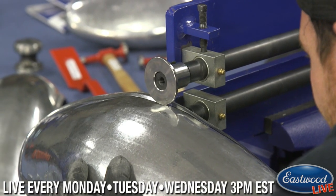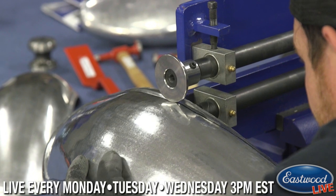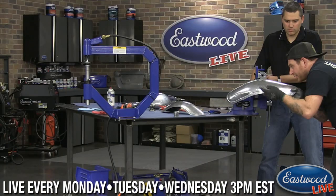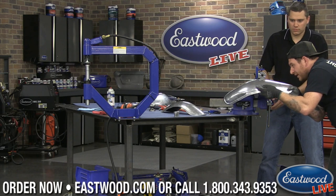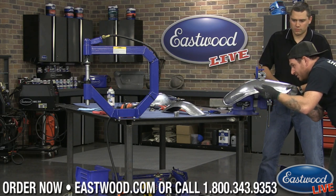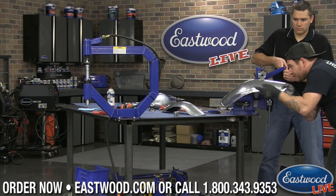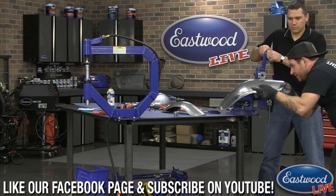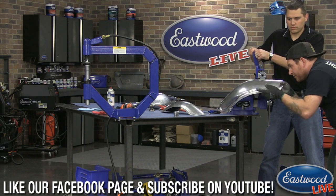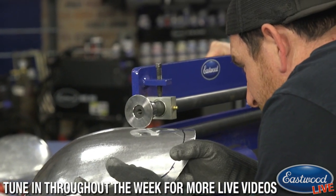So the key with rolling this, when you have a helper, is smooth and steady. You don't want somebody that's stopping part of the way through. I've seen some guys modify their bead rollers and put big car steering wheels on them, like a 50s car steering wheel or even something from a semi. It allows you to continuously turn the wheel without stopping. If you have problems with that, you can also work it by yourself a little easier. All right.